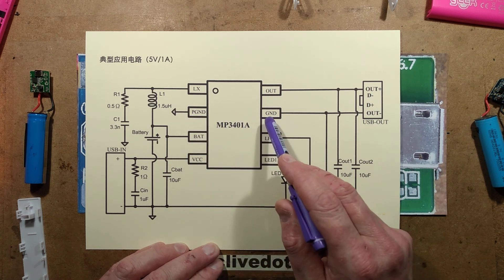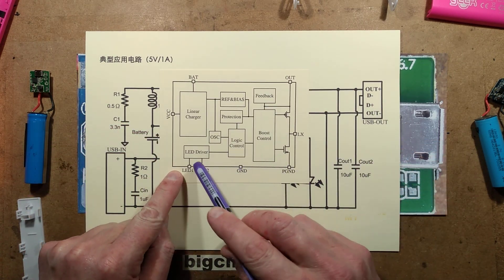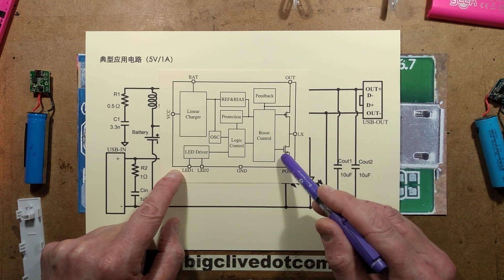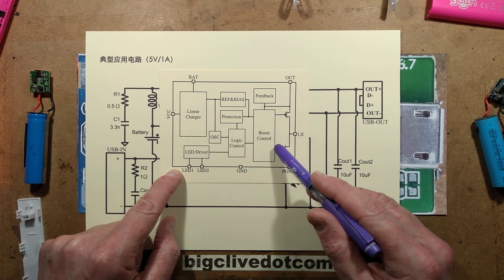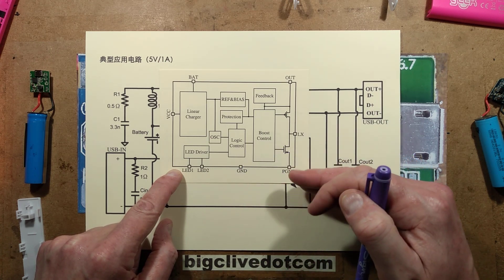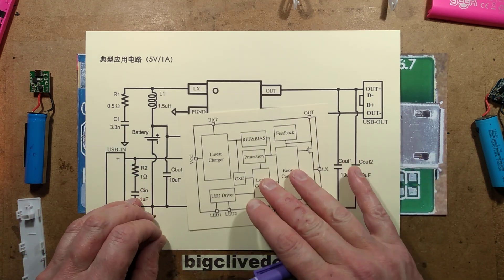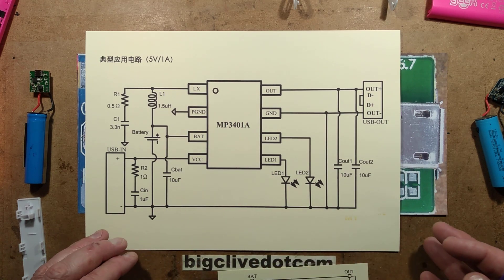It's made an effort to keep the power ground and signal ground separate. The reason they have two separate grounds on this chip is that the circuitry has a dedicated ground for the main MOSFET that's switching the inductor on and off, where a lot of current is flowing. The reason they keep the ground separate is because that will be subject to quite high current spikes, and because of voltage drops across the integrated circuit and the wire link leading to the pin of the chip, it can cause oscillations and voltage transients in that ground which would affect the rest of the circuitry — giving false readings from its reference level. They're connected together on the actual circuitry, but they keep the power ground close to the battery to avoid that interference.